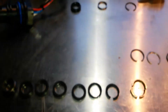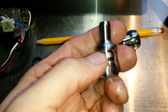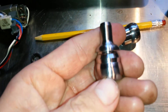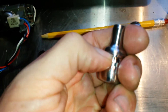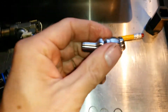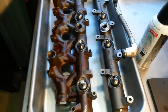We recommend upgrading to our nipple cups, which actually have a deflection groove built in. Not only are they made of hardened tool steel so they'll probably outlast your truck, but if that nipple cup seal ever does fail, that high-pressure oil is just going to hit this deflection ridge and get harmlessly dispersed away so that shattering will never happen. These have a lifetime guarantee and cost less than Ford will charge you for a brand new oil rail.